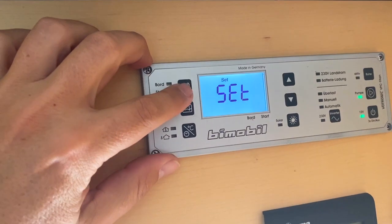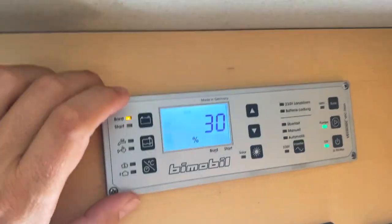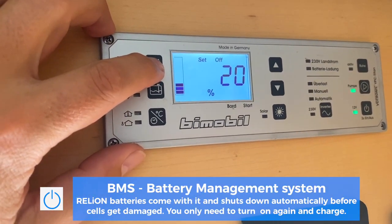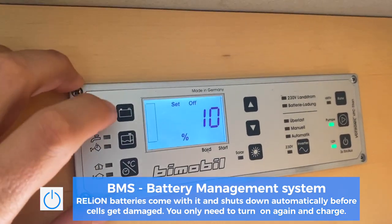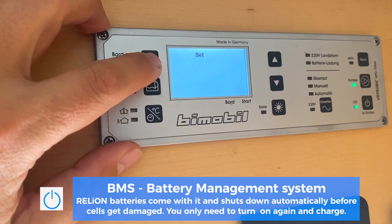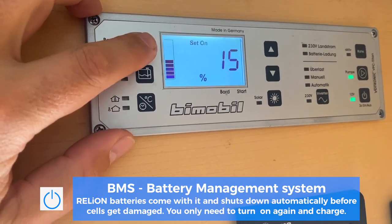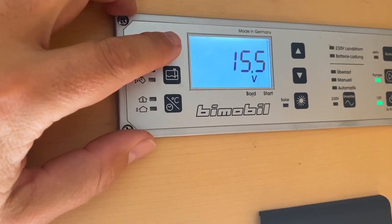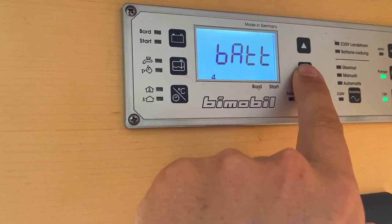We set 400 amps. The first alarm goes off at 30%. The first shutdown is at 20% — but I can restart from there. At 10% it will totally shut off and I can't touch it again. At 15% it will come back on automatically. This is the set-off voltage so we can't go lower. And the battery type is set to lithium — that's what we want — and we're done.